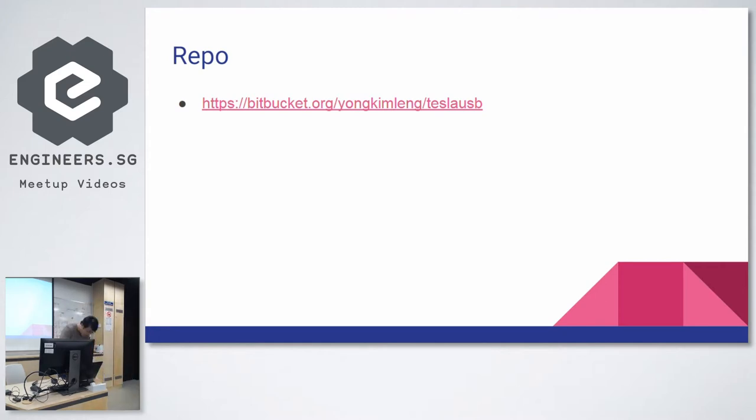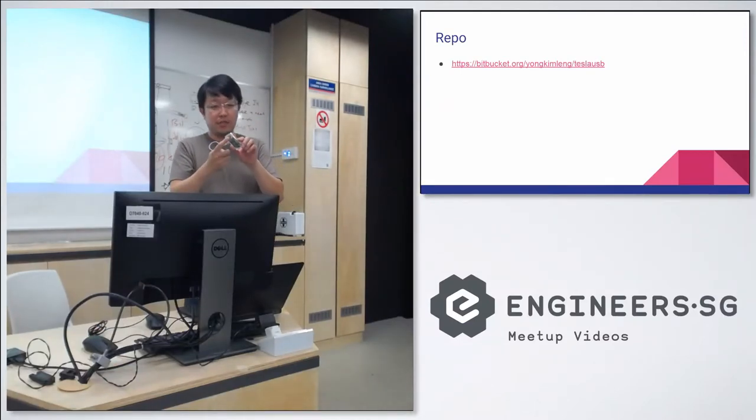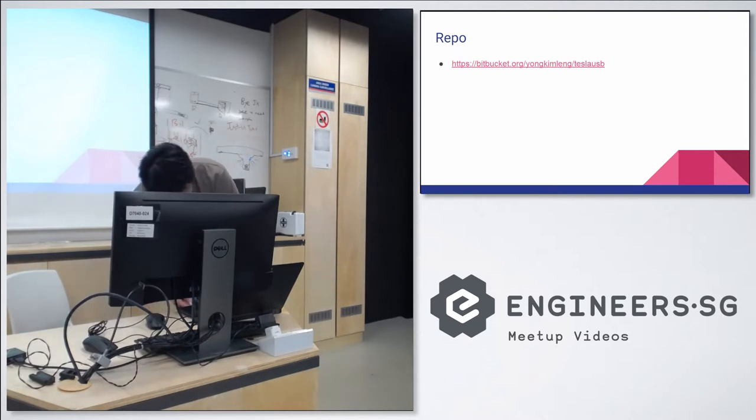If anyone has not seen a Pi Zero, it's really small. It still has a full 40 pins of GPIO, SPI, I2S, two I2Cs, and all the other stuff on it. Then you just plug it into the USB port.